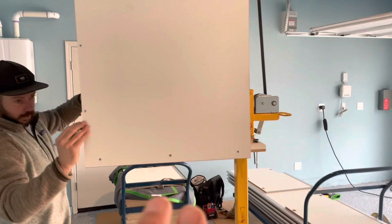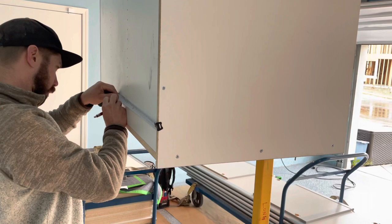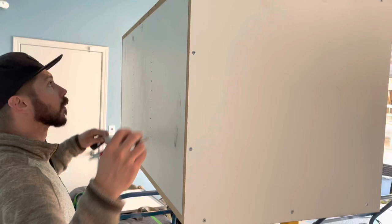We've got the lift in the house. We've got an upper that's going above a fridge — Matt's doing layout. The nice thing about this is when you're doing these small cabinets, we can put it on the lift, have it in the orientation where it needs to go, and not be bending over on the floor. Works really nicely.